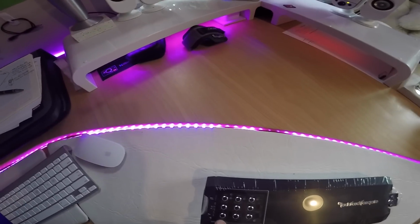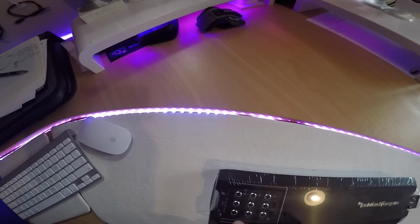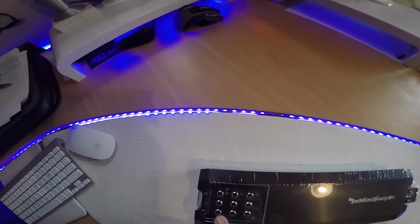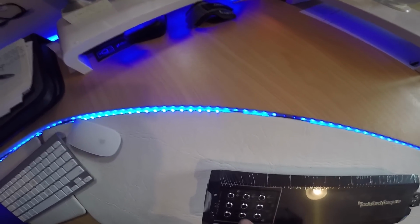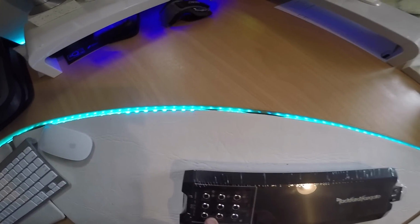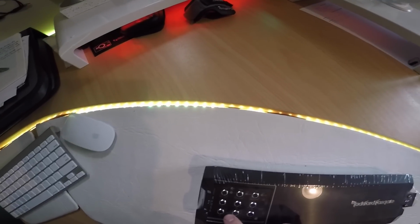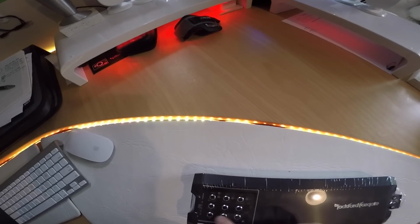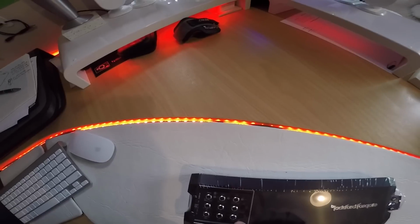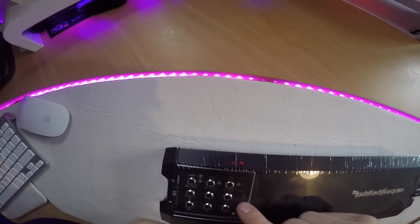And then at the bottom we've got our 3 frequency control pots. So we've got 50 Hz round to 250 Hz on all 3 of them, and beside them there are little switches that say LP, AP or HP, which stand for low pass, all pass and high pass filters. Same for the front and rear. And then beside the subwoofer channel side, we've got an infrasonic filter on-off switch.